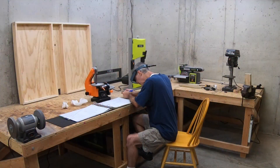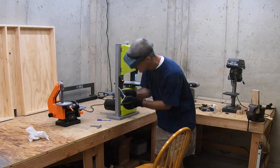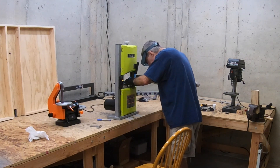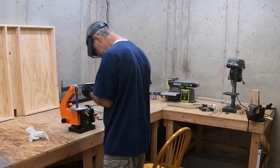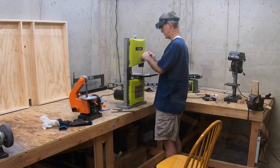Another thing I've done over the past couple of weeks is I remade the left front spar attachment bracket. There are the parts I ordered from Vans — six bucks each for those two five-inch long pieces of angle. I threw in some extra bags of rivets just to make the shipping worthwhile. You'll notice I'm wearing gloves here — I learned my lesson last time when you're cutting through those thick pieces of aluminum.